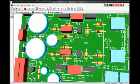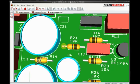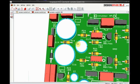Anyway, you can't see them here, but there are two big capacitors on the board. I'll turn it over. They're actually wired in series, C26 and C16, so each one's about 50-60 volts, so between them the whole voltage will be across it. I've forgotten what they're rated at now. I think they're 1000 microfarad, but in series it'll only be about 500 microfarad.